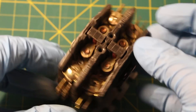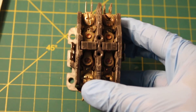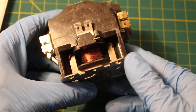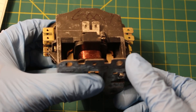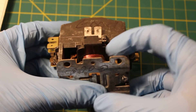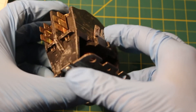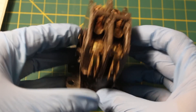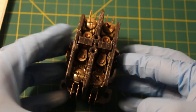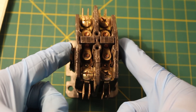Let's go over this again. I chose this contactor because you can clearly see all the components. Here's your coil — if you look closely you can see the coil is connected to these terminals on this side. So your coil for this contactor is right here. One side of your coil and here's the opposite side of your coil.